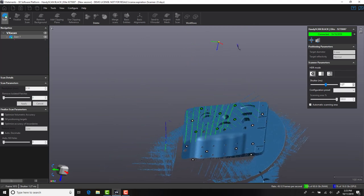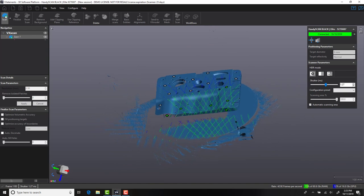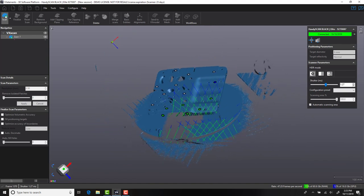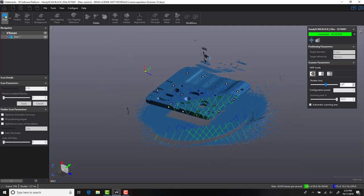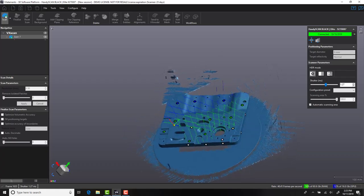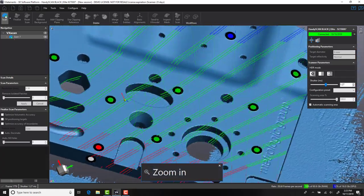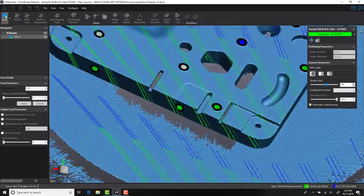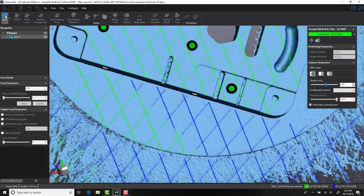In this section, we are 3D scanning a component consisting of some quite complex geometrical and surface-based features. To achieve an accurate result, we are utilising the HandySCAN BLACK from Creaform for this process. High quality scan data is one of the key aspects to achieving a good result when producing your CAD model. As you can see from the output, the system is capable of scanning at a very fast rate, around 1.3 million points per second. The level of accuracy achieved on this component would be expected to be around 25 microns